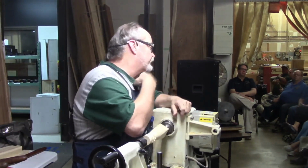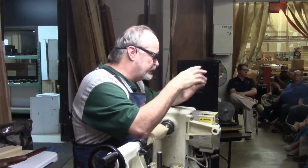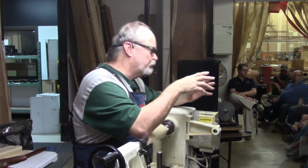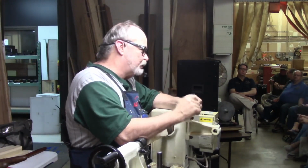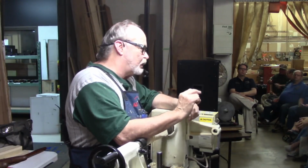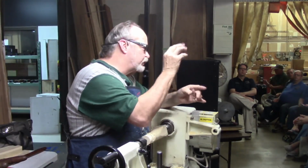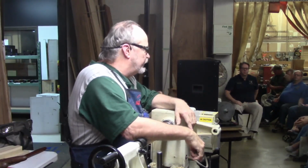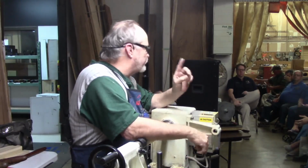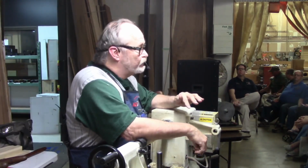Still, this professor, PhD in metallurgy from MIT at Crucible Steel, he measured those burrs, and he said some of the burrs I was pulling up were only 4 thousandths of an inch tall, but you know what? The human hand can feel it. That's the mystery of the human hand. It can feel 4,000ths and 5,000ths. He couldn't believe it. But yet he had to admit there was a burr there. But that's for finishing. Very fine finishing. But it'll give you better than any bowl gouge if you learn how to do it.